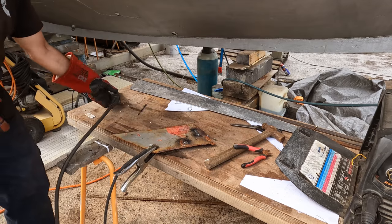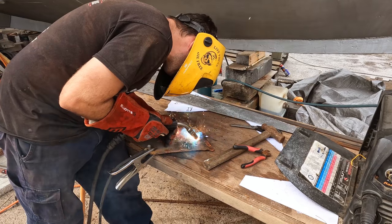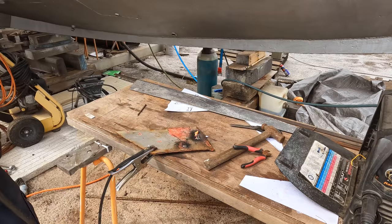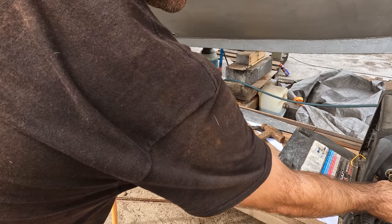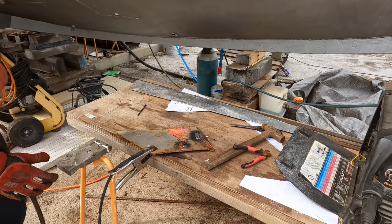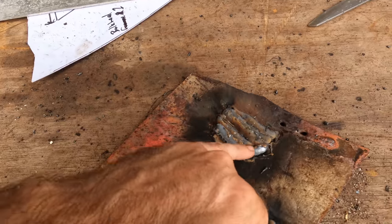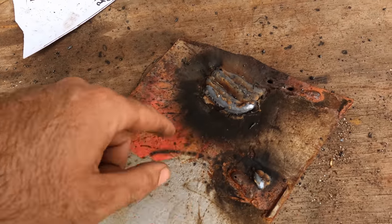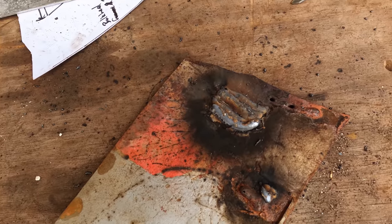All right, there we go. Tiny little cold weld. Let's crank it up and I'll show you what it does. Right, so heaps more metal coming out, much more control. Seems to be working, lovely. I actually like to run it a bit hotter than the factory settings, so just bump some temperature into it. Did a wee bit of tuning and started to get a much smoother bead. Admittedly, it's on crappy, rusty, painted steel, so I'll probably need to adjust it slightly when I start getting into the nice new steel, but it's welding really nice now.